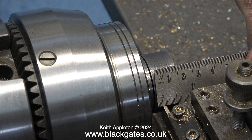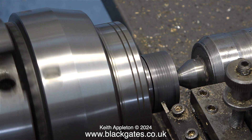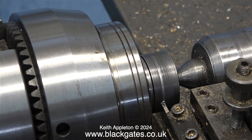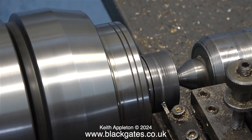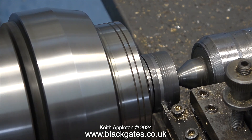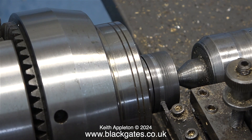A lot of engineering jobs are accumulators — you start to make the part and it takes quite a while to get it to this level. I've already made two episodes just showing the turning of the piston blanks, so I really don't want to foul it up at this stage. I'm not using cutting lubricant because cast iron is sort of self-lubricating as it has a lot of carbon in it.